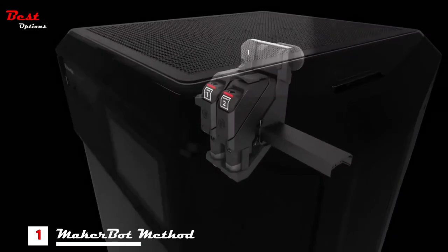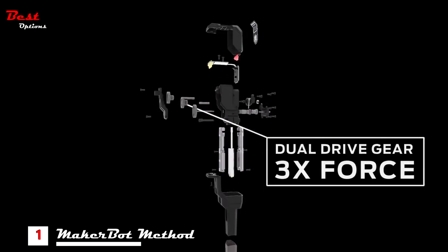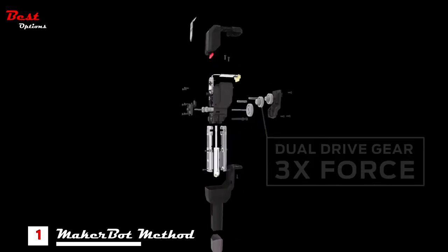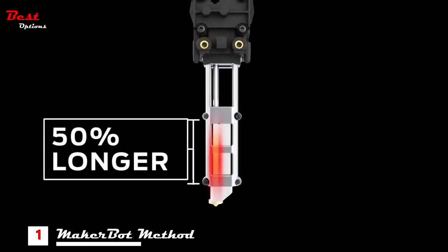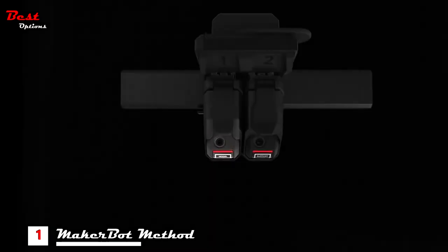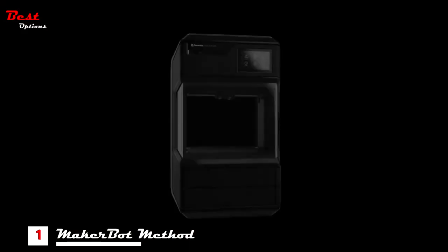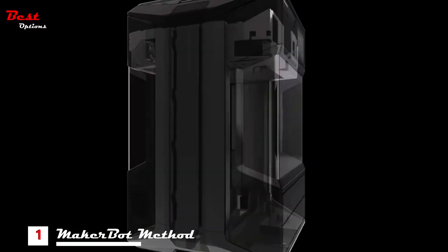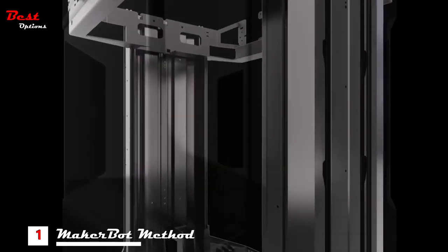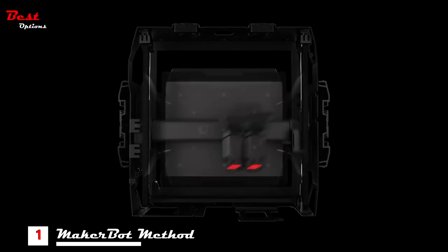The seamless orchestration between the dual performance extruders provides a consistent feed of hot liquefied material across every print layer. The dual drive gear system grips material securely with three times the force of a typical desktop 3D printer. The extruder's length and thermal cores are 50% longer than a desktop hot end, allowing for more efficient heating during the entire material loading and extrusion process. Method allows you the freedom to print in virtually unlimited geometry by utilizing best-in-class water-soluble PVA support. A rigorously tested and ultra-rigid full-body metal frame design eliminates flexing that typically occurs during high-speed print movements, resulting in more consistent prints with better part accuracy and uncompromised performance.